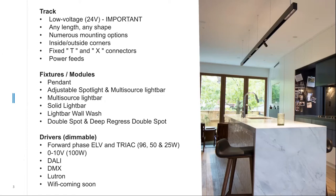We can utilize zero-to-10-volt dimming with a 100-watt rated driver, which also needs to be derated in most cases. DALI is available, DMX, and Lutron Ecosystem Control. Very soon we will be launching a wireless control protocol that will not only be available for CLIC but for many of our other fixtures.